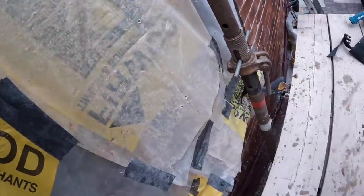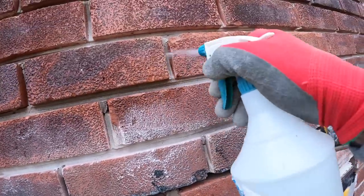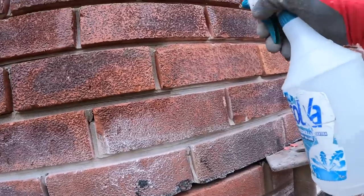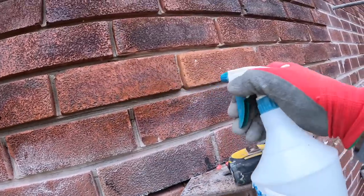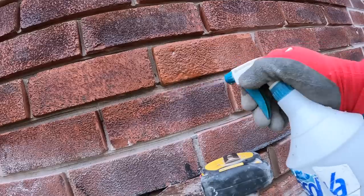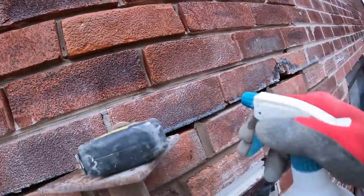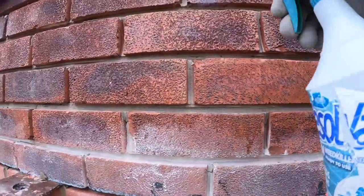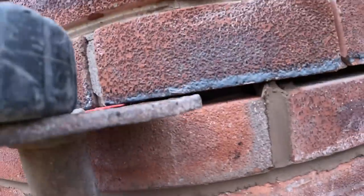Now she's just knocking a couple of rubber bricks out below, which isn't on the job. It's just a ropey patch job, and it's not part of our job, but Alex decided while we're here, get it done, which is, why not? So yeah, once this is all damped down, I'm going to get it pointed, and then we'll get this top bed joint pointed.